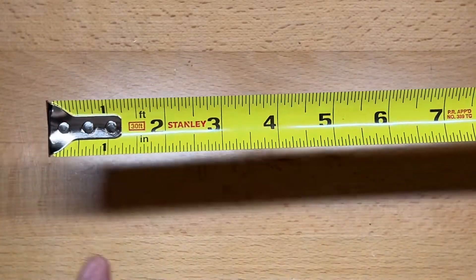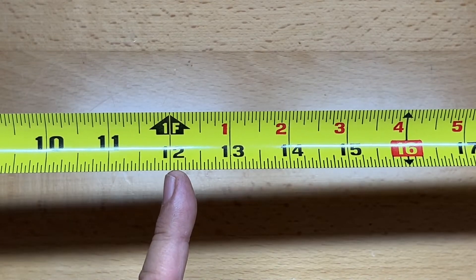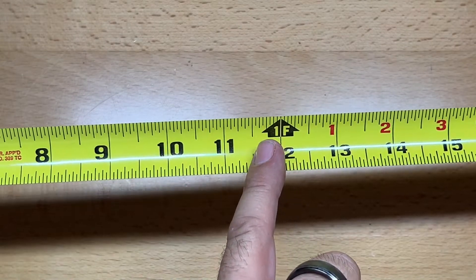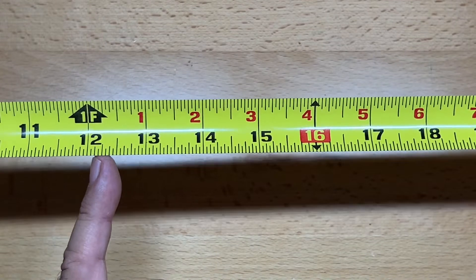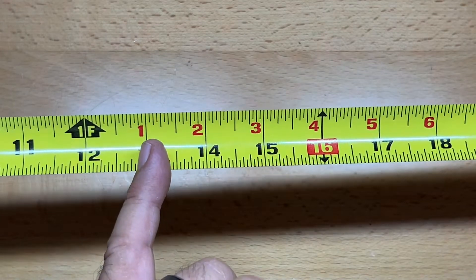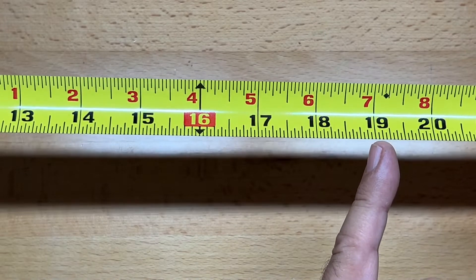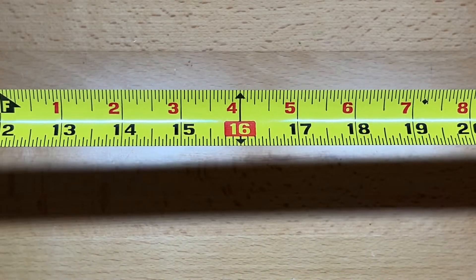With the standard Stanley, the inch marks start out in black and continue all the way up the tape measure. Once they get to the one foot mark, they go down to the bottom but continue all the way up to give you the count of inches throughout the entire tape. At every one foot mark, they are denoted with a black arrow — one foot, two foot, and all the way up. Also at the one foot breaks, they list the inches in red starting over at every foot mark. So instead of reading something out as 19 inches, you would say it's one foot seven, giving you a quick visual reference.